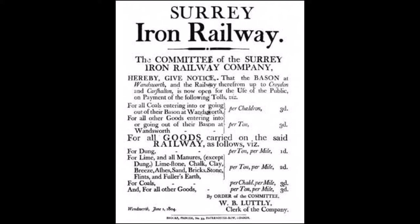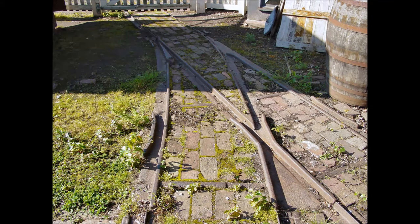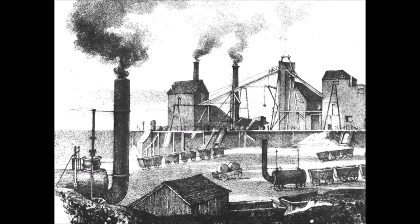There were also longer horse-drawn lines, completely freight-orientated, like the Surrey Iron Railway, which moved at the speed of a walking horse. What they tended to use were stone blocks — stone cubes with a hole drilled in the top into which a wooden peg was driven — and then a rail, either L-shaped with the flange on the rail, nailed into those stone blocks. Later, the innovation came of using sleepers or wooden cross ties every couple of feet, onto which you would fix the rails.